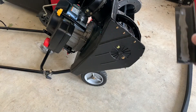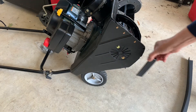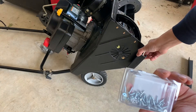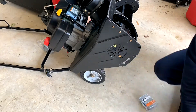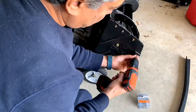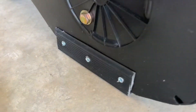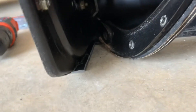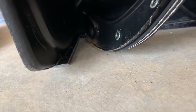I have applied epoxy here and I'm going to fix the strip in place and use these short screws to make sure it is properly reinforced. So this small rubber piece has been installed — there is epoxy inside it and it has been secured with screws. It seems like it has created the required clearance, as the auger does not seem to be touching the floor now.